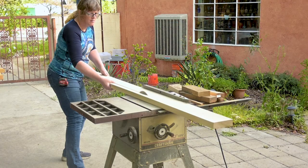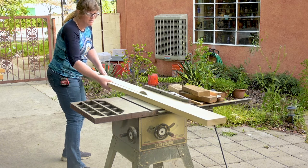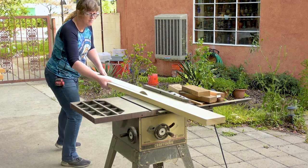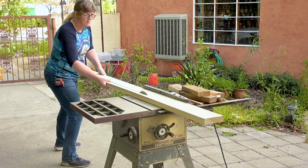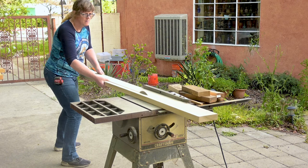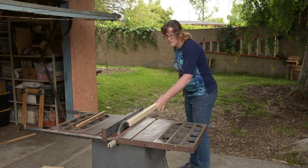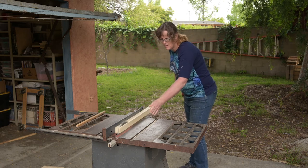Again, although I demonstrated this method in this video, I am absolutely not recommending anyone actually let go of the lumber, go around, and finish the cut by pulling the saw through for the second half. Please build an outfeed table, enlist the help of a catcher, or flip the board after passing the halfway point. These are your safer options.